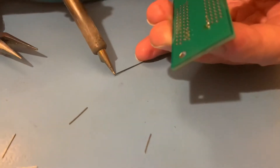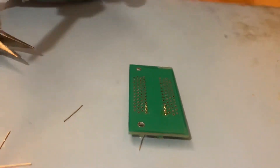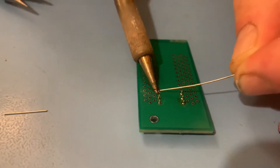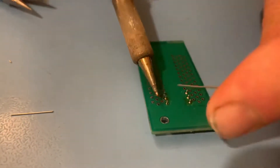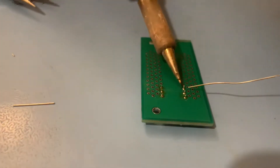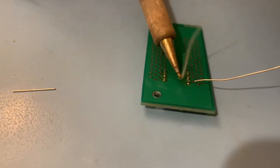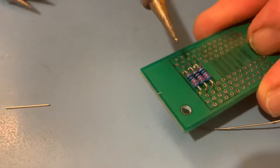I'll just tack this final one in. So they're all tacked in now. I'll go to the other end and feed the solder in for two or three seconds — you need it to go through the barrel, and you should get a little bit on the other side of the board. I can then revisit the first end and do them properly. Two or three seconds and it should go through to the other side. There you go — six nice joints, all fed through, all in a row, nice and flat to the board. That's the basics of a resistor fit.